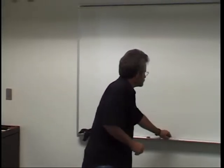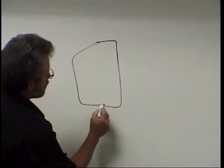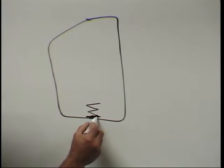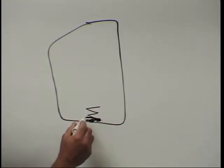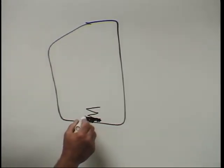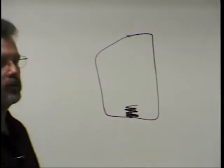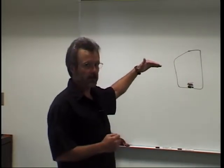A shelf is formed at the bottom of the plate that is the desired width of the weldment. If we have a plate and we want to do a weave up, we've been teaching you the Z motion. As you come across from one side to the next, the metal is building up, and this is the shelf that your book is talking about. As you go back across, the next layer lays on that shelf. And as you recall, once over and once back, you only advance about the diameter of the welding electrode.